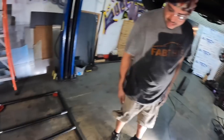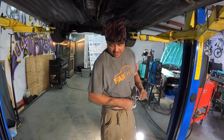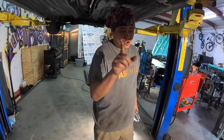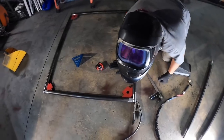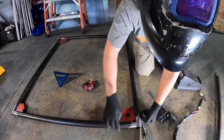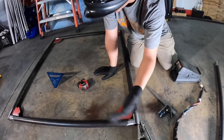Wipe it all down with acetone so make sure it's always clean — get those good welds, get the colorful welds. You'd actually weld this with that FUPA cup. No one will ever see it, but they will know there's rainbow welds on the car. I also tack it on the top here to allow me to adjust it — if you tack it here you can't bend it, tack it here you can bend it both ways, tack it here you can't bend it that way.